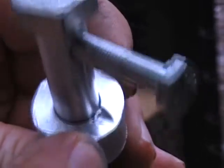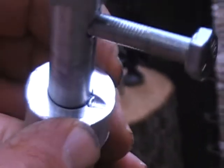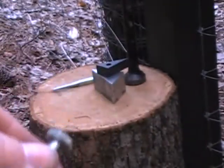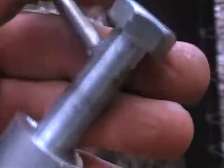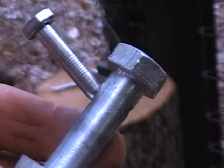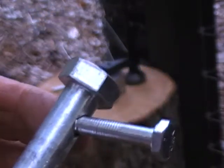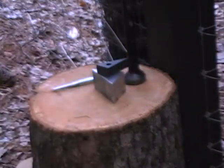6061 aluminum, like an aluminum breech, unless they're made out of 7075 or 2024, which is a little stronger. And it kind of distorted things a little bit. So that's why it's stuck. But anyway, it is not sheared off. It is bent. And we'll try and unscrew it and see what it looks like.